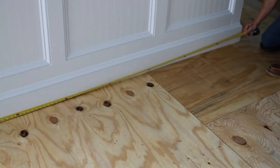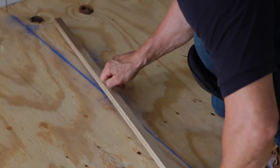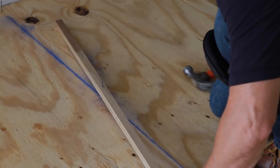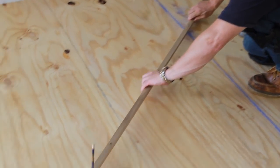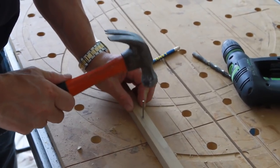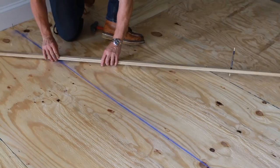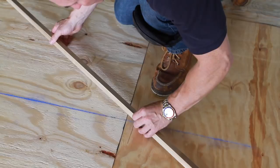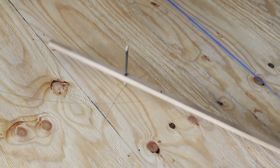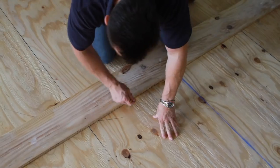There's a lot of prep work involved before you can start laying any flooring. Start by finding the center of the room and marking it with a chalk line. To create a perfect rectangle for your herringbone field, you'll also need to mark a perpendicular line using a trammel — a tool you can make yourself with a long strip of wood. Drill a hole for a pencil near one end and drive a nail through the other. Set the nail point on the center line and swing the pencil to draw an arc on either side, then reset the trammel on the other end of the line and swing it again to cross your first set of arcs. Connect the intersecting arc points with a straight edge, and now you have two perpendicular lines to work off of.